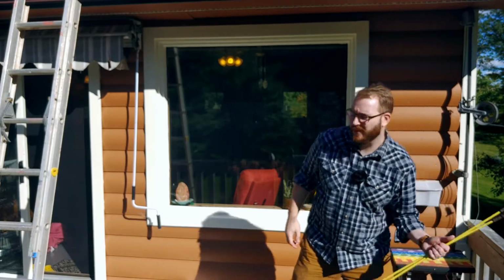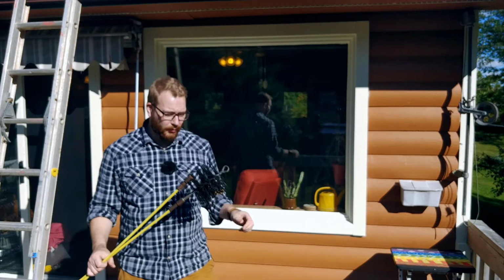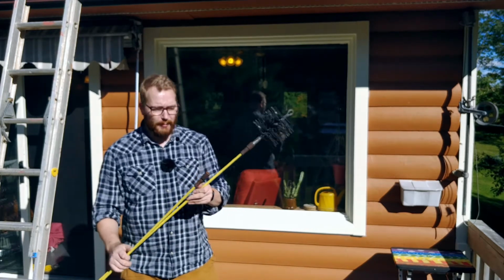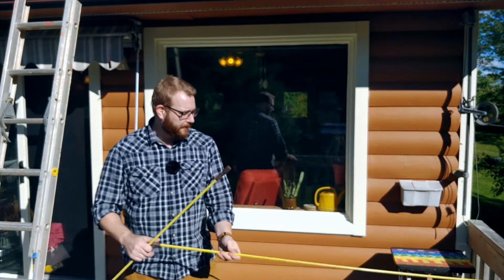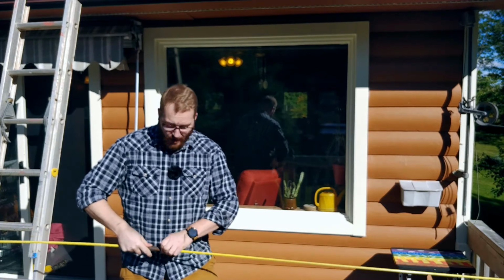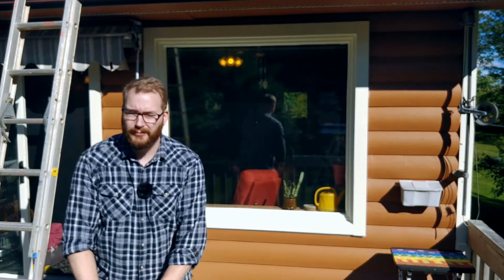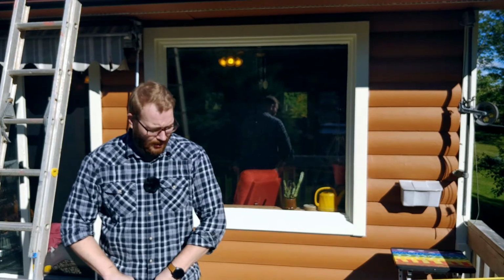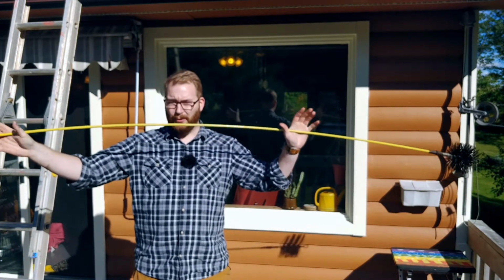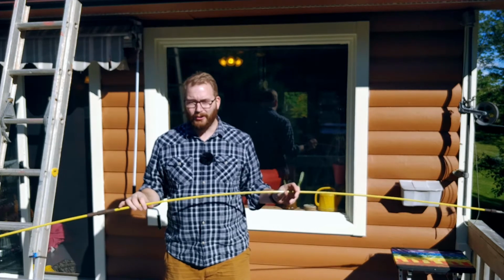So to sweep the chimney, you need a chimney brush. Mine's a stainless steel stovepipe, so I've got to use a nylon or a composite brush. If you use a steel brush, it's just going to mar the inside and ruin your pipe. You get it on fiberglass rods, and they screw together to make longer lengths. I'm lucky, my stovepipe is straight from the stove up through the ceiling and out, so I only need 2 lengths. I got off cheap, but this is going to be your tool. This is the only tool you need up on the roof, provided your storm cap's not screwed down. So let's get up there and I'll show you just how much I love ladders.